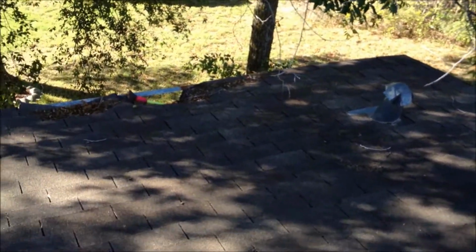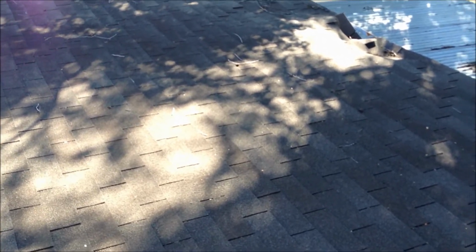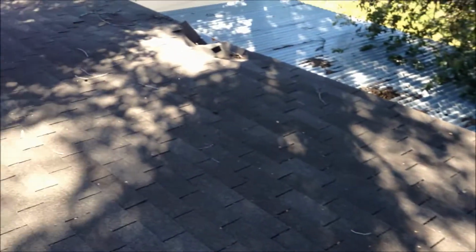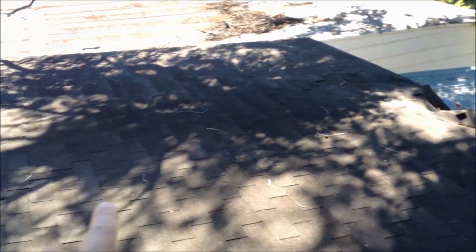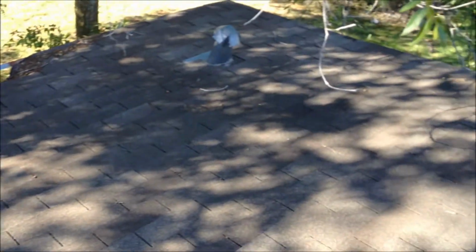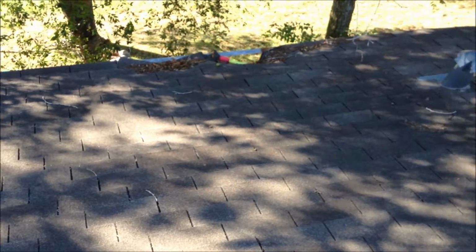But real important, if you're going to have a patio cover built or anything like that, make sure they put on a roll roofing product, not shingles, because you'll at some point have a situation like this. So the cure for this is we've got to take this whole roof off, which is about 35 feet across and 15 feet this way. We've got to replace all the decking that's rotted, and then put on a flat roof material. That'll take care of the issue, but it could have been prevented in the beginning by putting on the right kind of roof.